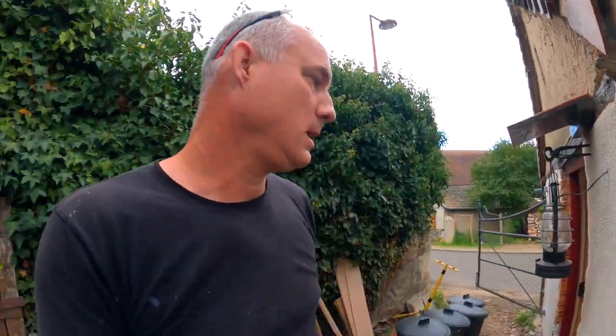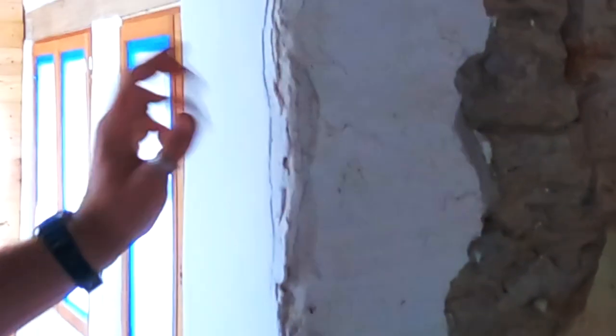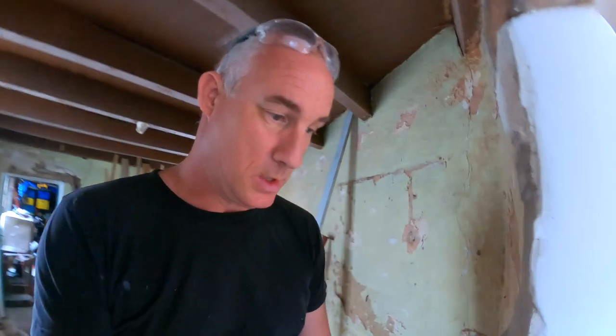That's the exterior, and then the interior. What I've done is, I can't show you, can I? No, maybe I can. Yeah, I can. On the walls inside, I've used Renopass as a primer, and on top of that I have put a coat of just lime and water. You just make a really sticky, muddy batter and you smear it on, and later sand it smooth, and then I have painted it with a wall paint that is suitable for these porous substrates. So that is what I have done. I hope that clears it up.